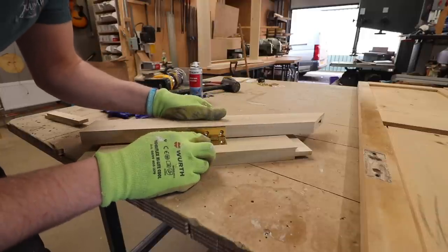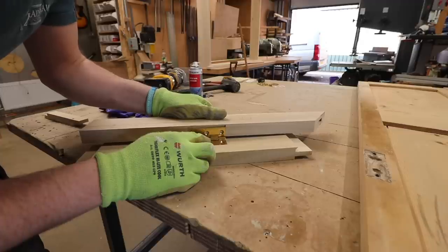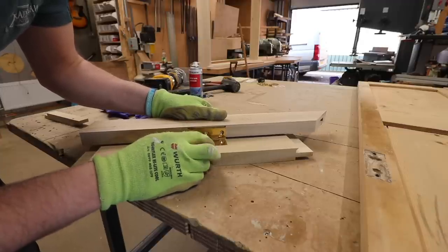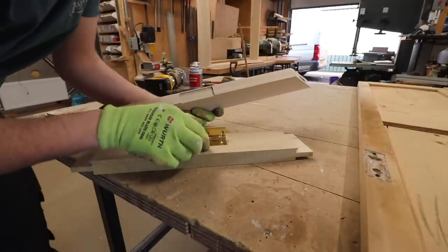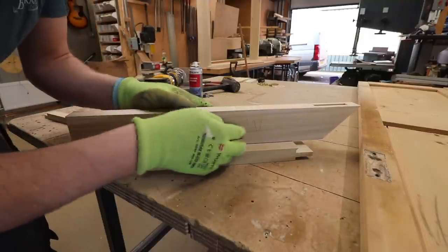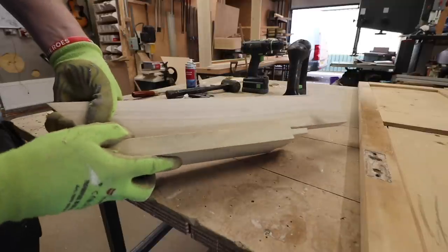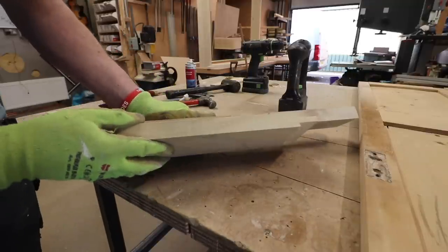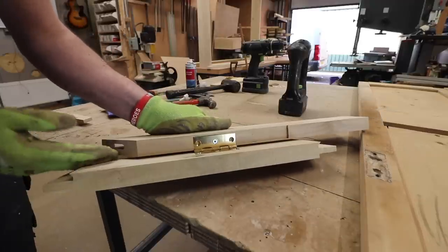So I've got to set this hinge up so it brings this shutter a couple more mil off this frame when it's open, which is going to set this hinge a couple mil more further in this direction when it's in the closed position to maintain the correct alignment in this face. There we go, that's given me just a couple of mil when it's open of leeway so that those beads should clear the frame.